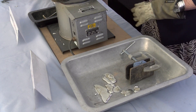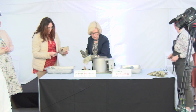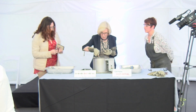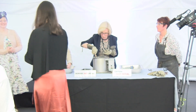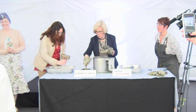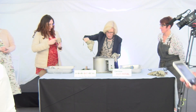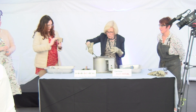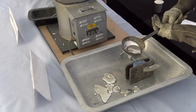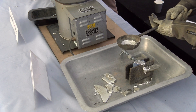You're welcome - you can just cut the sprue off now and just file around. Its nose should be pointed so you'll have a bit of work there. Just scrape the dross off the surface. Just pour that in - keep going, keep going. That's it, that's fine, that's good.